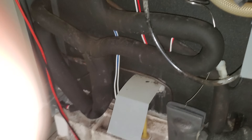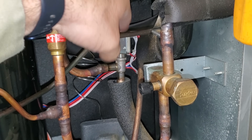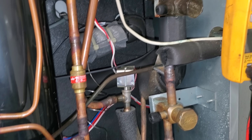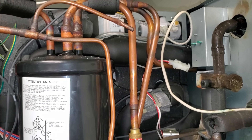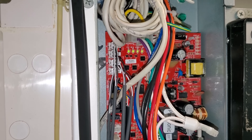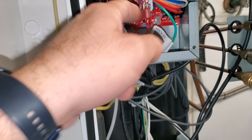We're going to check voltages. We got no voltage on the left harvest valve or cool vapor valve. On the right, I can clearly tell this one is still energized — I can feel it. This harvest valve shouldn't be energized; this air pump should not be energized — it should be on the opposite side. I figured it out. Look at the LED lights: I'm moving the left side, but the left side is actuating the right side, and the right side is actuating the left side. Our switches are crossed.